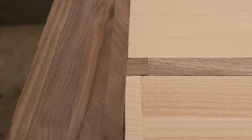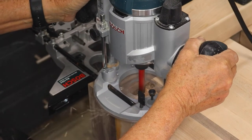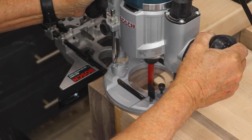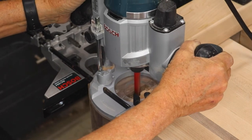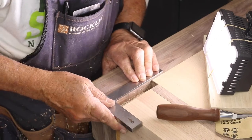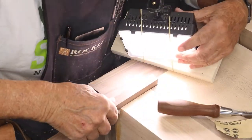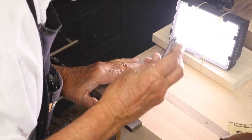Time to bring out the big guns. I route out a really nice deep and even slot, then use my chisel to get it as fine-tuned as I possibly can. It's very helpful to use a straight edge to aid your eyes in seeing whether or not you chiseled straight lines. I still had a problem so I kept working at it.